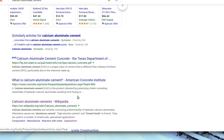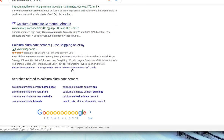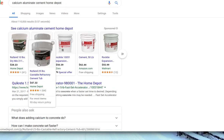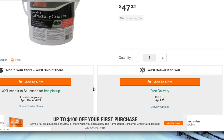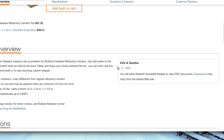The mold itself is going to be highly accurate — that's the great strength, especially if you're following through with plastic molding, which copies the mold very accurately. For steel casting, I've read that premium casting of steel can actually get pretty good accuracy — in the range of 50 to 80 microns over 10 centimeters — with really good surface finishes. But the accuracy you get depends on the casting process.